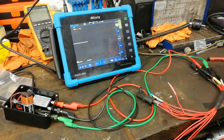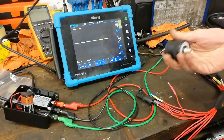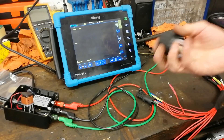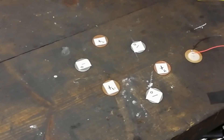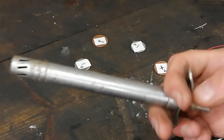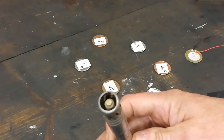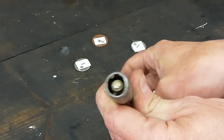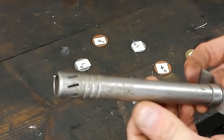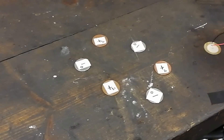So that's a bit on transducers. I'll maybe set this up on the car and give it a go in the oscilloscope. Now for the piezoelectric effect - here's probably the simplest piezoelectric device: a gas lighter. We energize a spring by pressing the plunger and it releases and thumps a piezo crystal in there, creating a voltage that jumps the spark gap. That's our gas lighter with no power, no batteries - just like me hitting that disc.